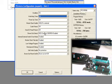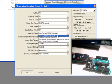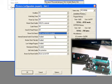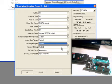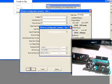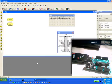Master clear is good, but the Cipino has an external master clear — we're not going to use it, but keep it set to external. We'll turn off brownout detect, and importantly, turn off the low voltage programming option — it won't work if you don't turn that off. Make sure you do that and click OK.